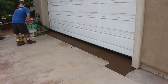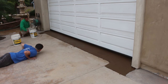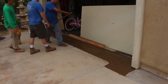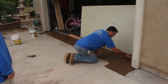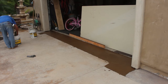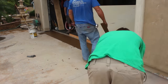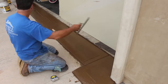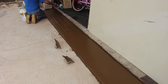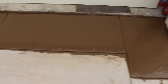The main reason this band came out is that when they originally put it in, they matched it to the garage floor. The garage floor was not level — it had cracked in the middle and raised — so when the band was put back in matching that floor, the garage door had big gaps under both sides when it came down. Now we've put this band back in level, not matching the garage floor level, so there's about an inch to an inch and a half step up in the center. That garage floor could potentially come out later and be matched to the band. One thing is for sure — when you do it like this, the water is never going to go into the garage because you have that step.